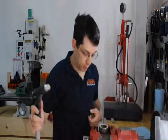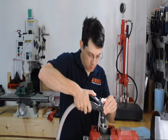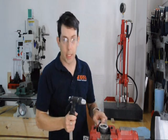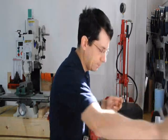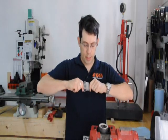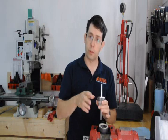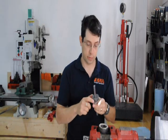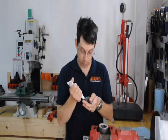We'll clamp this up in order to put the cap on, then put it in water almost to the top. We don't want any air on the inside — that will make it really hard to pressurize. When we put the cap on, we'll make sure the piston is about halfway. When we put it on and screw it on, it increases the pressure on the inside a little bit and that will push the piston out a few inches. We'll use a little bit of Teflon compound on the threads.